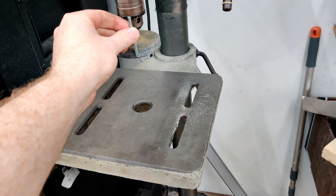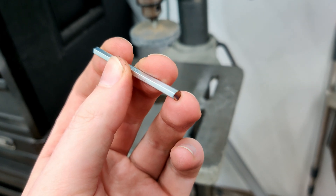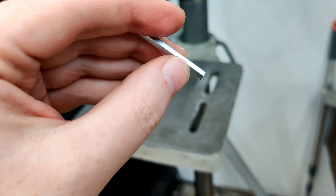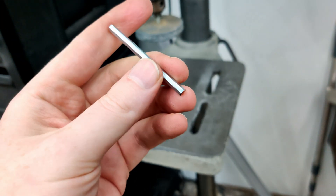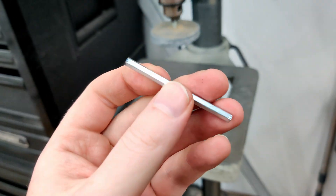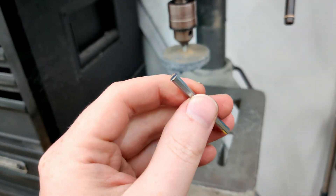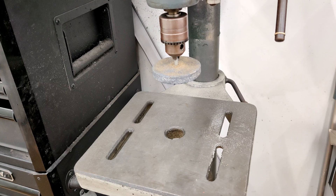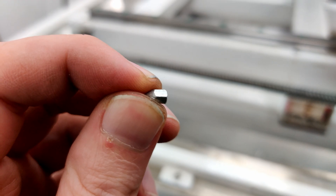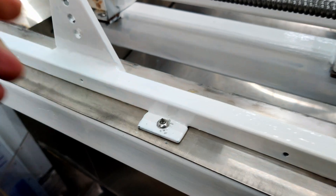Put the piece in the drill press and use your flap wheel to put a point on it, then swap to the cutoff wheel and chop it off, then start over — back to the flap wheel, put another point on, cut it off. You do that for an hour or so and you realize maybe you should just go to the store and buy the professional ones. But there is a benefit to doing it this way — here, if I drop it in like so...